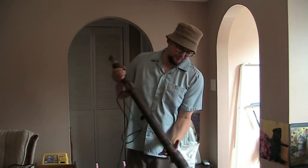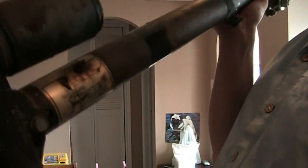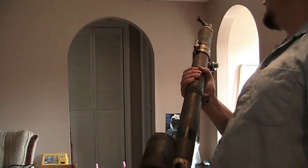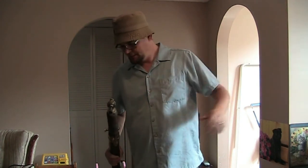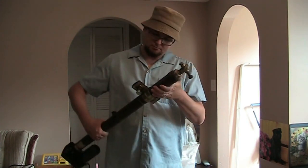The last thing is the actuator. These things are heavy. It has one of those grease nipple fittings - I had a grease gun and tried to grease it up to get some more life out of it. One trick I discovered with my dish is when it didn't have enough stroke to reach one end of the arc - I had it aimed on the right side to push the dish east - you can just loosen this up and move it, and if you need just that little bit extra, you can position it there.